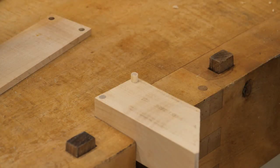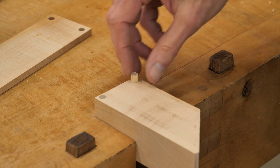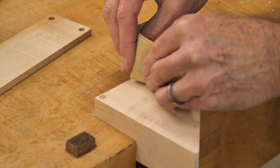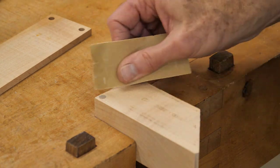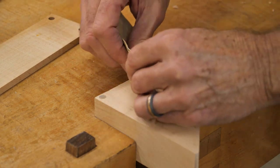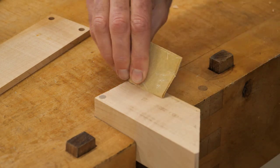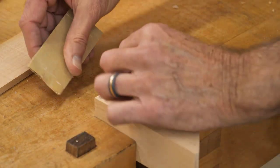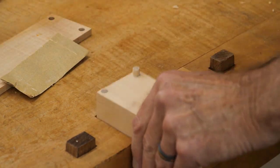This piece is going to come off and on a couple of times, and it's easier to do that if those edges aren't sharp. So I just want to knock those corners down a little bit on those dowels — just going to make it a little easier to reassemble this. We need to drill the hole for the cross pin next.